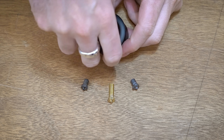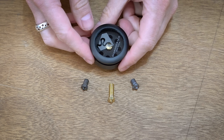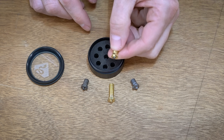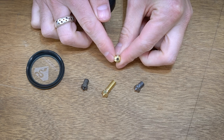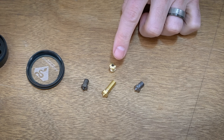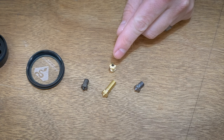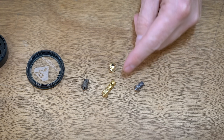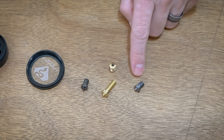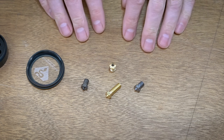If we open up this Diamondback nozzle and look at it a little bit closer, it comes in a nice little aluminum case. You can see it is basically a brass nozzle with a little diamond tip on the end — just the tip. Now, diamond is actually a really good thermal conductor, so theoretically this should conduct heat the same way as the brass, it should not wear down because diamond is quite hard, and the filament shouldn't be sticking to it like it does with some of the other hardened steel nozzles. In theory, the promise is that it delivers the same performance as a brass nozzle — it just doesn't wear down.